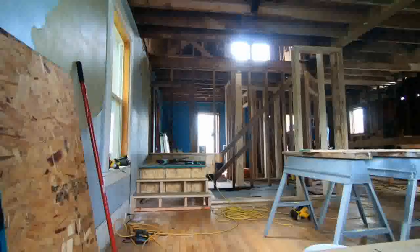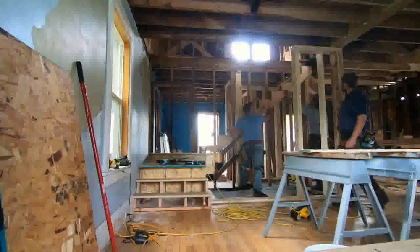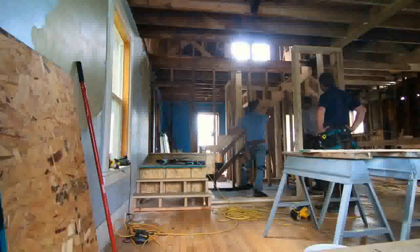Since the staircase is just getting carpet, we can attach the treads by gluing and screwing them, then use OSB as the backs, leaving about a 1-inch bullnose protruding out for the carpet to wrap around.